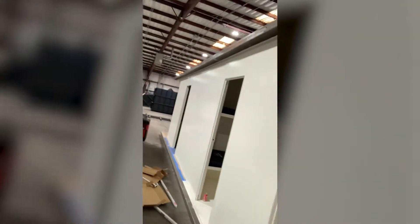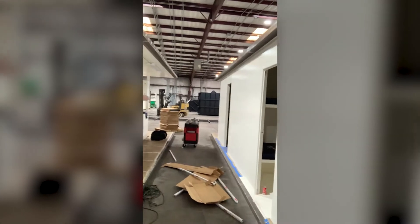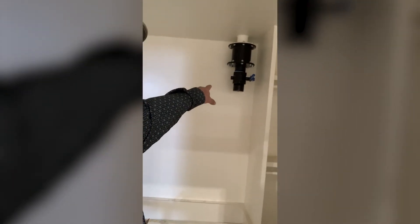This is what we call a double-wide. If you look on our website, there's a double-wide shelter on there — this is what it's going to be like. Kind of like a double-wide mobile home. If you look at the end down there, that's going to be a big living room on the end of this one. The reason that's hanging out in the air like that is because they wanted a free-spanning, opened-up living room, so there'll be big I-beams on top of that. Then we encase this thing with concrete around it. The master bedroom is where I'm at now. We've got the blast valve there — a Rising S blast valve that's been tested, engineer put them together, really nice product. Got a big brass valve that we paint black just for cosmetics, but that valve is also brass. Everything inside the blast valve is stainless, so you don't have to worry about any kind of moisture or rusting in a vent pipe.